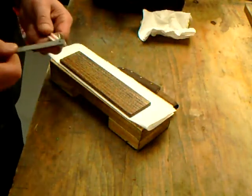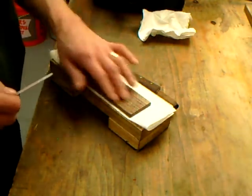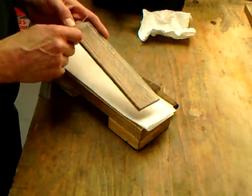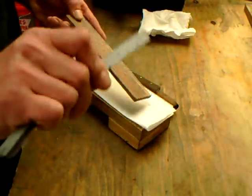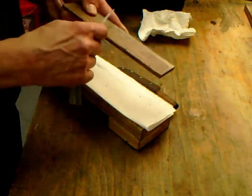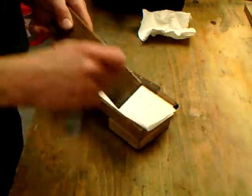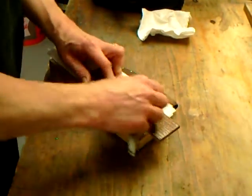Today I'm going to take a closer look at doing some lapping with an abrasive on an oak board — just a piece of quarter inch oak. I scribe it in line with a piece of hacksaw blade. I don't do this every time I use it, but as it starts to smooth out it gives the compound somewhere to catch. I'll give it a couple of scrapes real quick if it looks like it needs it.